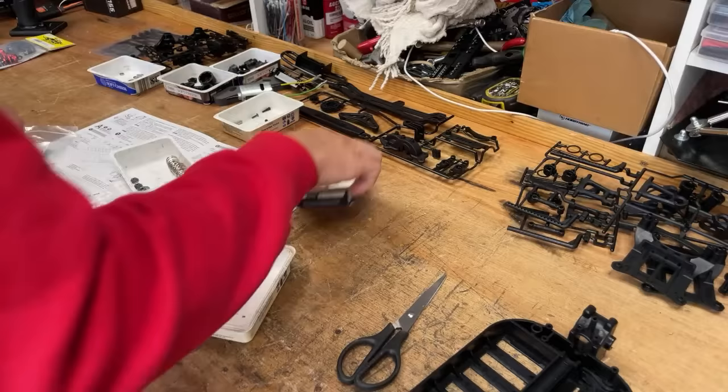So we got that, we got that. Now we need an M3 screw. And of course, it's not going to be in the same one. That's going to be in a different pot altogether again. M3x6, I'm guessing it's that one. So we get our vernier and measure from the shoulder to the end of the thread. Yeah, that's near enough, 6 millimetres. They never bang on. All right, and then we need the motor mount, which is D3.